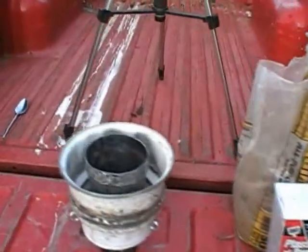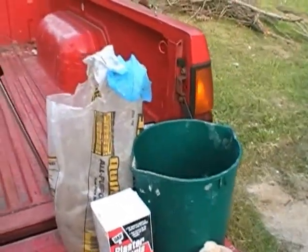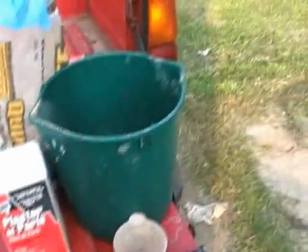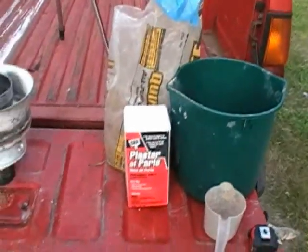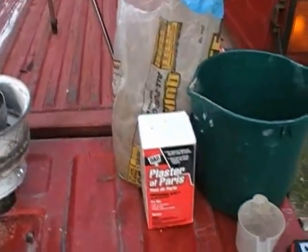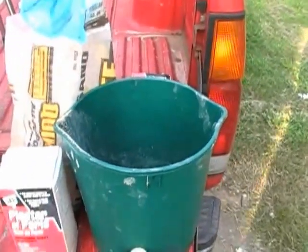So with this guy right here, I said 60-40 mixture. I'm probably going to go ahead and use 12 cups of sand to 8 cups of this right here. That way I'll have plenty of it mixed up. I'd rather have too much than not enough. I'm going to pause and start getting everything mixed up, and I'll let you see the mixture after I've got it ready. You don't want it soupy and you don't want it too dry.